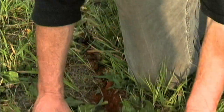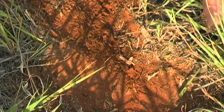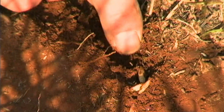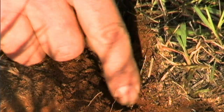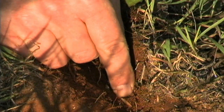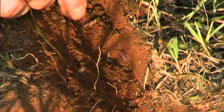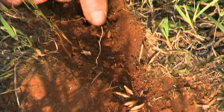Even though the soil was breaking away in clods, you can see it's packed back very well. The press wheel has come along after the muffler wheel and made sure we got good seed-to-soil contact. Just have a look for the seeds here — we can see they're pretty well down at the bottom of the trench. I've got about 120 kilos per hectare — it's heavier than anyone is likely to put on, but I've done that so that it's easy to find. Just pull away a bit of soil — plenty of them down there, and they're all about the same depth. The soil is pretty friable around them, due to the muffler wheel crunching the soil back down. You can see there is a bit of root coverage, and this was planted at speed at 15 to 20Ks, and you still get very good seed placement.